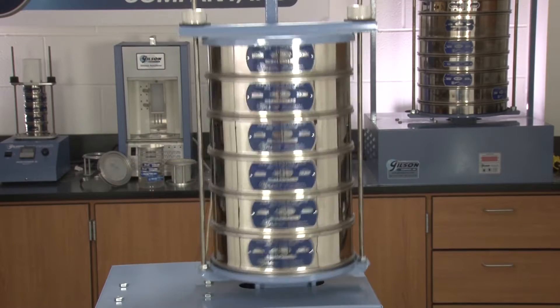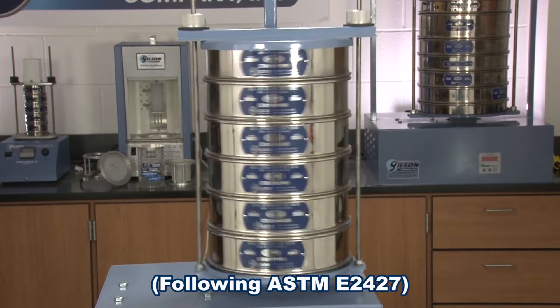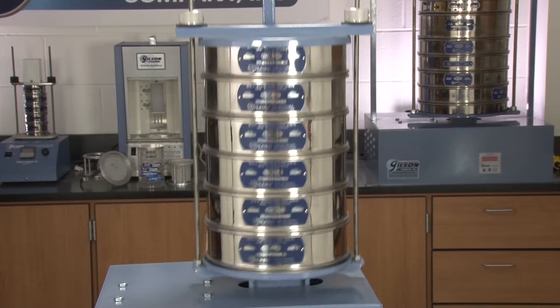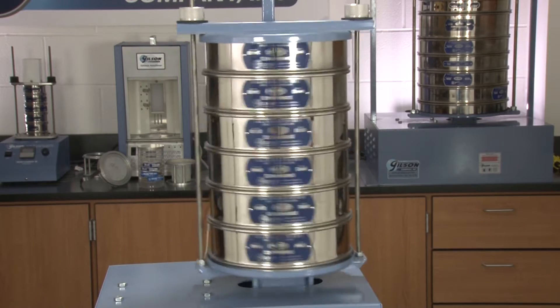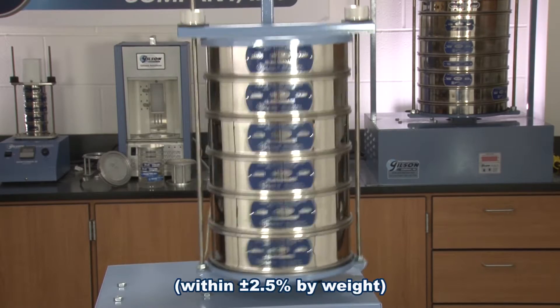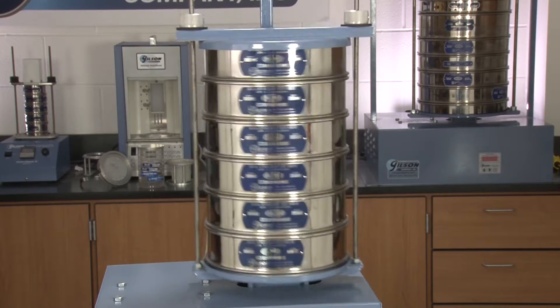Following the recommendations for user-prepared materials in ASTM E2427, the master set is performance tested using a properly acquired representative sample or standard reference materials. Results can then be compared to results from the same performance test on working sieves to determine the accuracy of the working sieve.